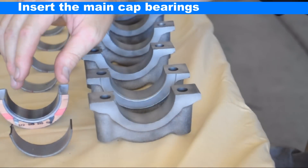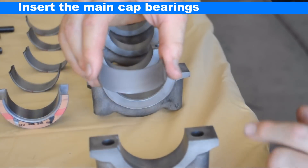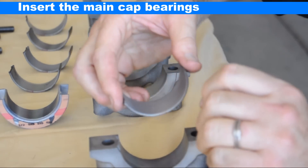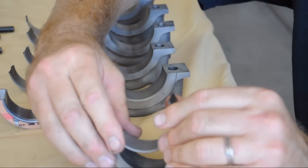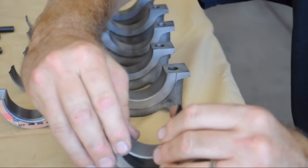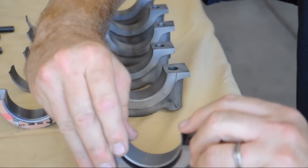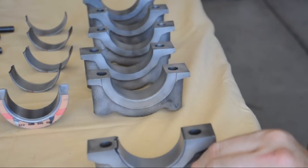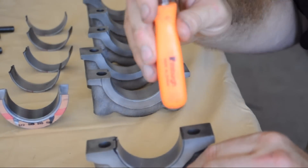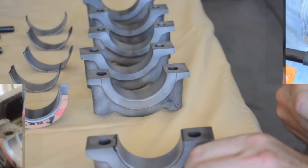We kind of skipped this on the motor, but it's the same way. Don't touch the bearing surface, and don't drop it. Clip in the side with the notch, sort of even, and push it in there. If it sticks up a little bit, take the back end of a screwdriver and tap it very lightly — tappy tappy — until it's nice and smooth. That's it.